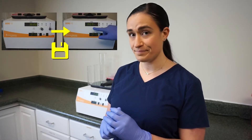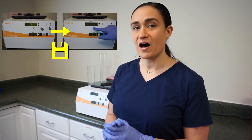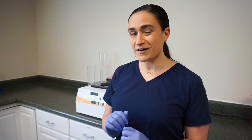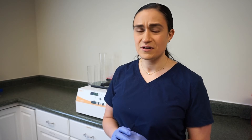Today we're going to be creating a new saved cycle with the speed set to 3600 RPM, the time set to 15 seconds, and the brake setting off. Keep in mind that you could use this same technique to set any saved cycle that you want. Our saved cycle is a combination of speed, time, and brake settings saved to the memory of the SARA12, and you can still adjust any of these on the fly as well.